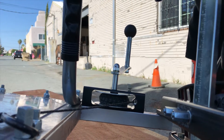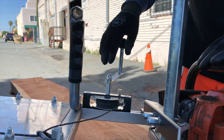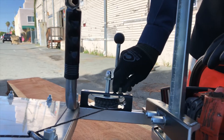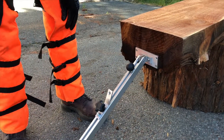This is really good when you stop milling before you leave the cut or when you're entering the cut and the line is not attached to the end of the log. You can tighten this up, and then the line will not become loose and get in the way of the saw.